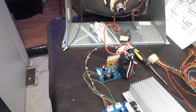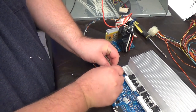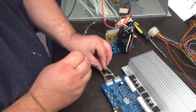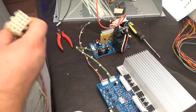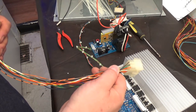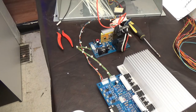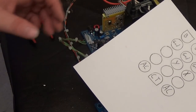Now I'm going to use more zip ties. I'll catch up with you in a minute. This connector allows you to plug the monitor itself into an Atari harness. This is already pre-pinned — I don't know if Fred's kit comes pre-pinned or you'll have to pin it yourself. Remember this diagram — I'm going to wire it up. First, we're going to do the power: AC, center tap, AC.